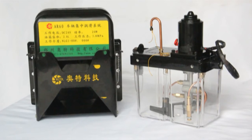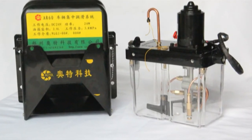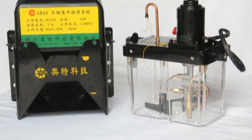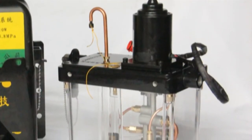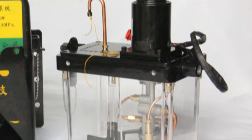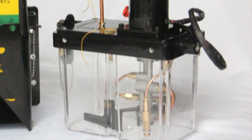As the operating core of the system, the grease pump delivers the grease inside the grease tank to every distributor under high pressure. The major components of the pumping station include a DC motor, gear pump, safety valve, unloading valve, cylinder and dialing unit, and grease filling unit.